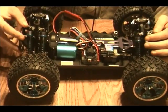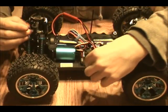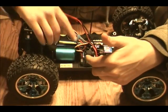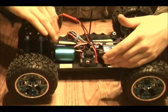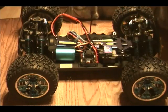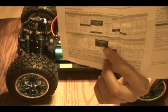By the way, if you happen to screw up the programming, one thing you just do is switch on the ESC — don't hold in the set button — and then press and hold the button. The ESC will flash three times and it beeps at the same time. After those three flashes, it resets the ESC settings to the factory defaults — these little guys right here.